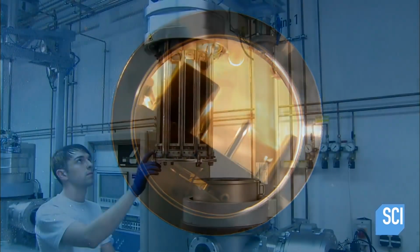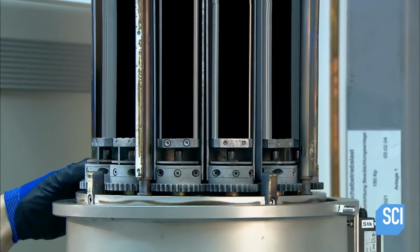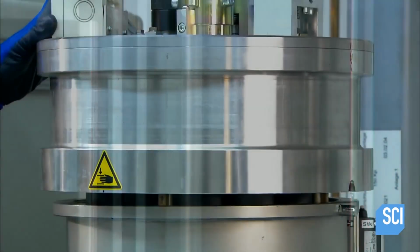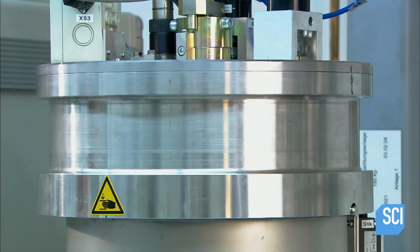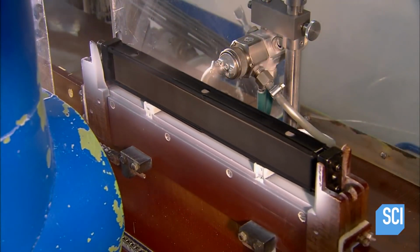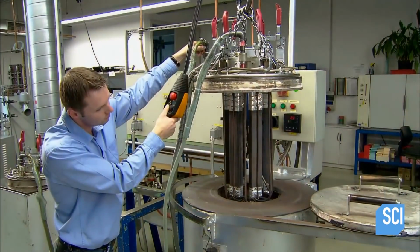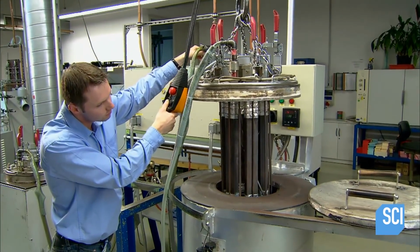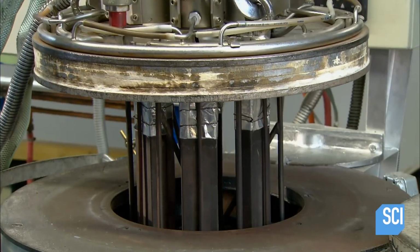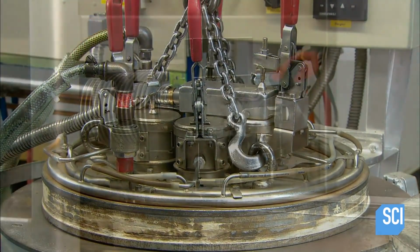The now pristine razor blades go into a vacuum chamber. It draws a chromium-based coating onto the surface, rendering the cutting edges harder and more wear-resistant. Next, spray nozzles apply a non-stick coating which will help the blades glide smoothly over the skin. To adhere the coating permanently to the blade surface, they bake it on for 20 minutes at about 660 degrees Fahrenheit.